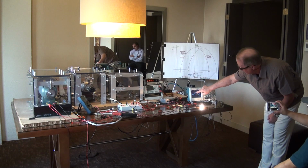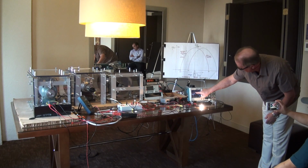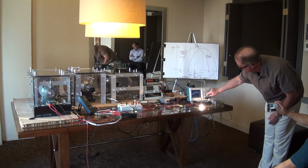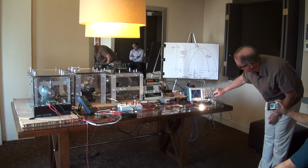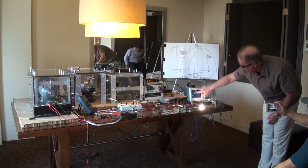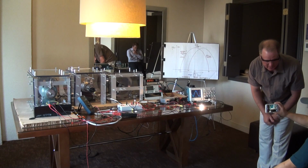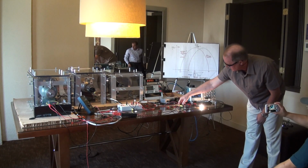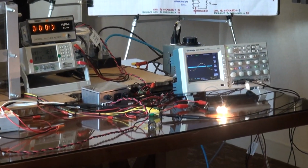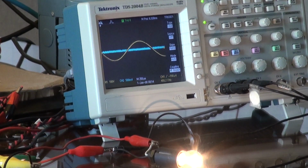So the middle line here represents the rotor magnet when it's right at the coil. So this is the rotor magnet, basically right at top dead center, and from this point onward, the ReGenX coil is accelerating the system. So I'll take the ReGenX coil off here. Now we're basically in regenerative braking mode, and the generator coil is decelerating the rotor.